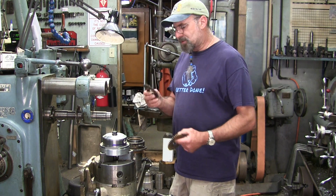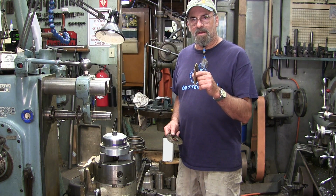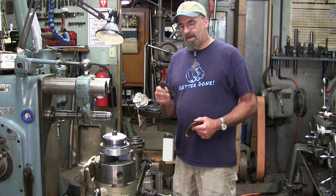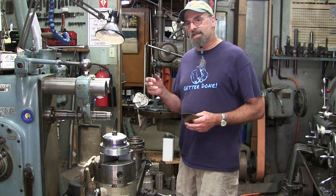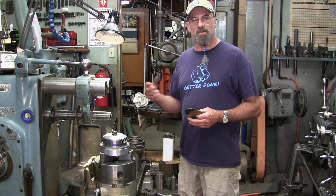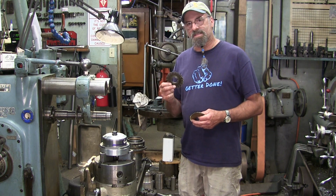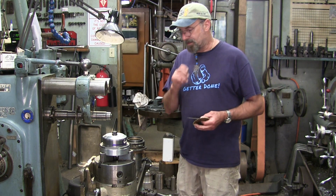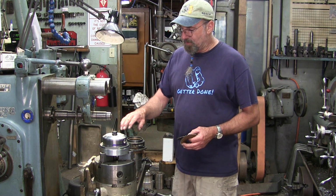And I'm choosing a stagger tooth over a straight cut tooth because I want another way of freedom of cut, just like the turbo end mill cuts and hogs off with less tool pressure and less effort. The stagger tooth cutter has the same type of characteristics. It has a free side on the tooth and it has a working side on the tooth.